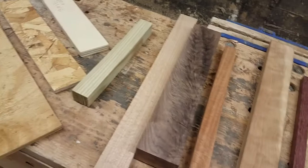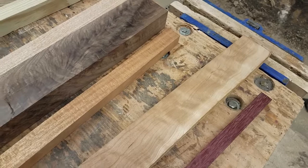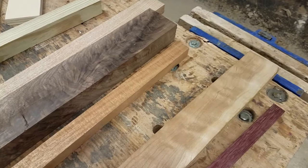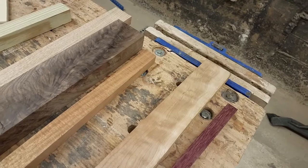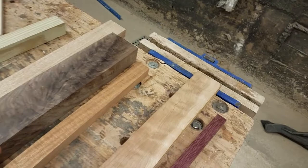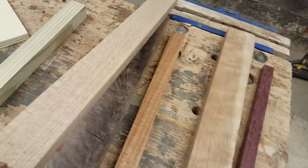That's a quick overview of some of the woods available. When choosing wood, I wouldn't stress too much about specific properties — mostly think about price and appearance. Check if there's a big crack or if it's really twisted, as you'll lose a lot of wood working with it. Wood bought at Home Depot will already be dressed but is much more expensive, which is why for any significant amount of wood I'd recommend going to a lumber yard. We also have local lumber yard recommendations on the Makehaven website and sell some wood here at Makehaven.